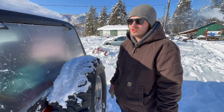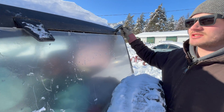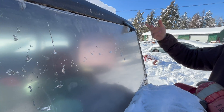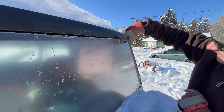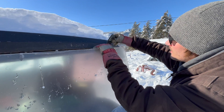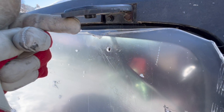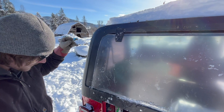It's a few days later and we got a whole bunch more snow now, but we're going to get it done today. No snow got in — thank God — and it's actually making heat in there. We can't take a measurement like that and drill right there accurately, so I'll get a ruler, go straight across and grab the center, then put it down like this — that's about as accurate as we're going to get. We'll drill slightly bigger holes so we have room to play — we've got some washers to act as a little gasket. Now that we've got the pilot holes drilled and lined up, we got it hung. We had to drill out the glass up here to accommodate the holes, and then it slides right in and it's nice and flush.